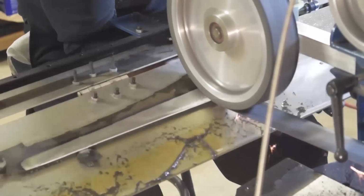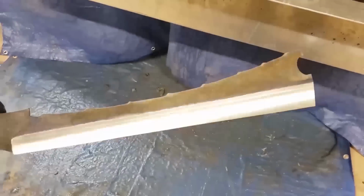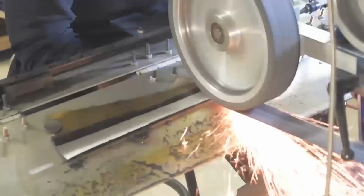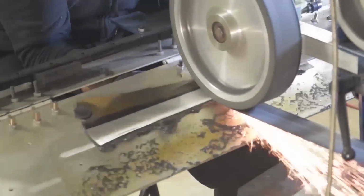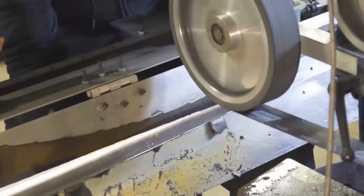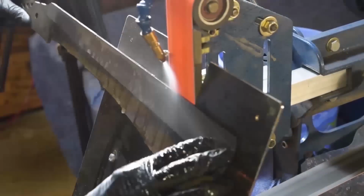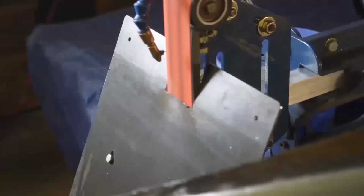So this I kind of used, you can see, going back and forth. There's door hinges that I drilled out. And there's the first side. Basically I mounted the two pieces of aluminum to a track with ball bearings that I can just mount to the tool rest and glide left and right. I've got the stool back there, I'll sit down, I'll move to one side, pull and push. I like seeing the hollow grinds as I go. It's not something that I want to do on the tool rest pushing away from me. I like to control that hollow grind.